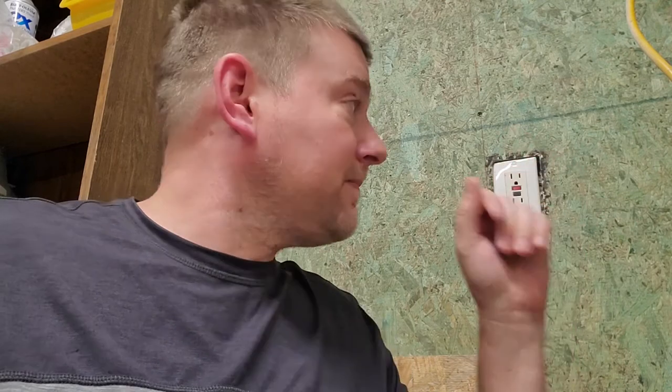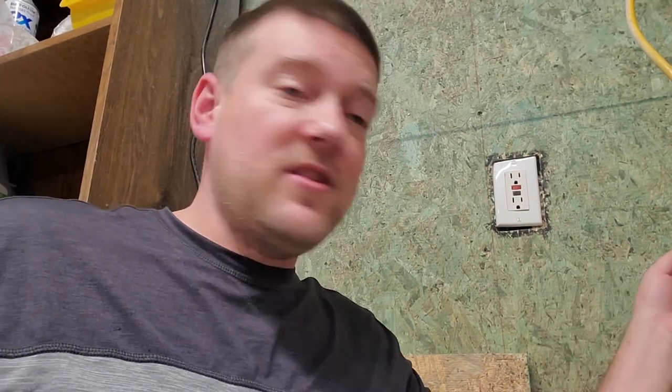You don't want to shut down the circuit because there could be a whole bunch of other things plugged into it. So in a hospital you'll usually have a line isolation monitor, which will alarm — you'll hear an auditory buzz plus a flashing light — because you don't want to disconnect power. In non-patient care rooms, especially in newer facilities, you will still probably see GFCIs. If you're a biomed and you're troubleshooting why you don't have power on one circuit but you do on others, it might be because there's a tripped GFCI nearby — perhaps near a bathroom, an external wall, or an entrance doorway.